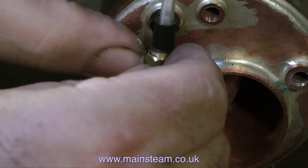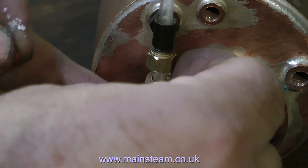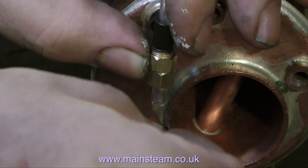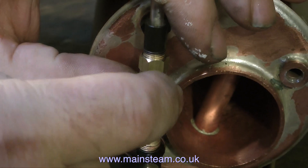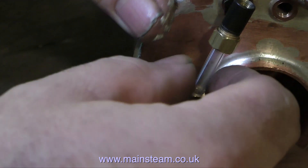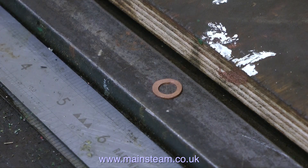The glass goes through the top fitting, and O-rings are put on the glass tube, then the nut is partially tightened. Don't tighten it all the way, otherwise you won't be able to move the glass in the fitting and you may cut yourself, particularly if the glass breaks. A nut goes on, and another O-ring goes on the bottom part. Bear in mind the ends of the tubes are probably quite sharp, so go at it square — if you go at it from a corner and the corner sticks in your finger, you will bleed all over your boiler and bench. Quick tip: if your copper washer is not the correct thickness, place it on a piece of steel and hit it with a hammer a few times to make it thinner.